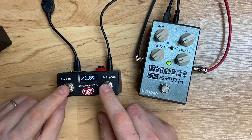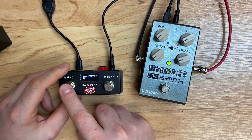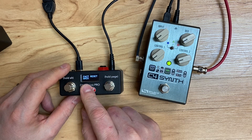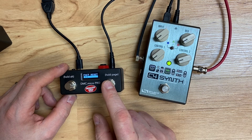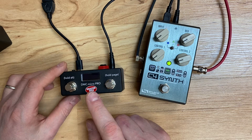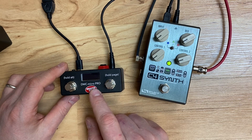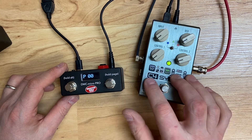Okay, we're powered on right now. Hold both buttons to enter setup, then go left to factory reset. Hold the left button to enter, then go right until we hit C4. Hold the left button and that's going to reset the Micro Pro. It's not going to overwrite the presets, but it is going to set up all the configuration so that it works with the C4.